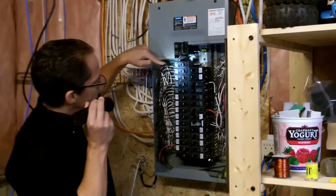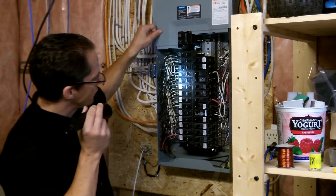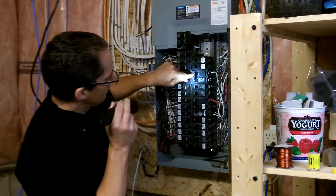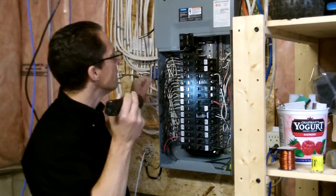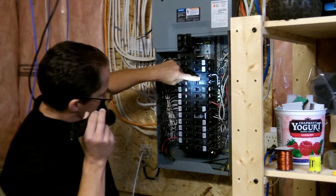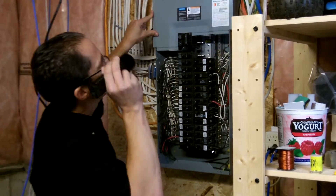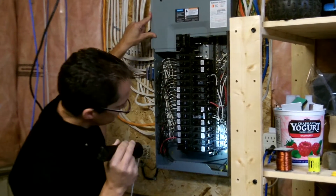The next thing we want to do is to match up the thickness of the wires to the size of the breakers being used — just want to make sure that homeowners haven't over-fused or over-breakered things. You can see the big fat wire going to the 40 amp breaker, a little thinner for 30, thinner again for 15. The biggest power consumers in the house are typically the stove, then air conditioner, then dryer. In this age of house, we've got the 20 amp breakers with the 12 gauge yellow wire going up to the kitchen. Gauge size to breaker size — there are no issues in this panel.